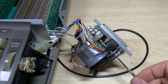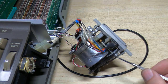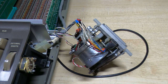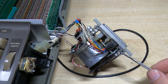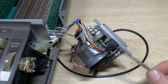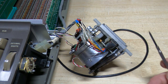Also I think whoever made this had Loctited the pulley to the shaft, and unfortunately they got Loctite all the way down and including into the bushing, so the whole thing was tightened up and it wouldn't spin freely. So I straightened the shaft, took the opportunity to put a flat onto the actual aluminium pulley as well as the O-ring, and bonded the O-ring to the pulley, so it's now one piece in effect.